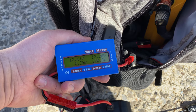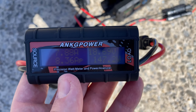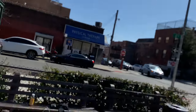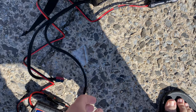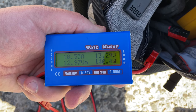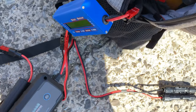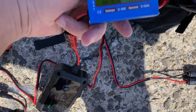140 watts, 10.61 amps, and the voltage dropped to 18.70 volts at 7.83 amps. Now we know the operating voltage is actually about 19 volts. Open circuit is 23.5 as stated. It's charging at a full 10 amps that the solar panel can put out — 10 amps at 140 watts. The input is 148 watts and by the time it gets here it's 142 watts.